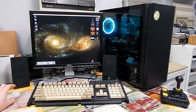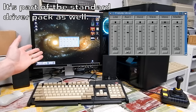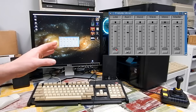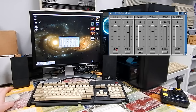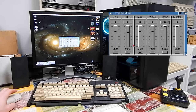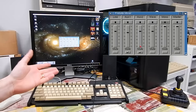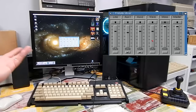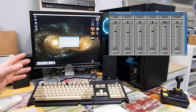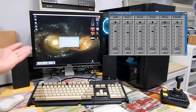The last thing I want to show you is the mixer. This gets installed as part of the Prelude driver pack from A1K Forums. It has line in — that's being used as the pass-through from the Amiga's native sound output into the Prelude. Auxiliary input 1 is presented on the back of the Prelude; Auxiliary input 2 is presented internally on the Prelude card, intended for connecting up CD audio. Wave is just the sound the Prelude generates itself. Master volume is self-explanatory.